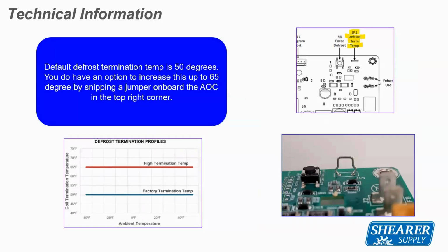Now let's talk about the operation of the unit. So operation of this unit, when you have a Y1 call, this unit will operate at 70% compressor speed. If you have a Y2 call, this compressor will run at 100% of its capacity. Now, it's being advertised or marketed as a multi-speed unit. Let me explain what that multi-speed is.